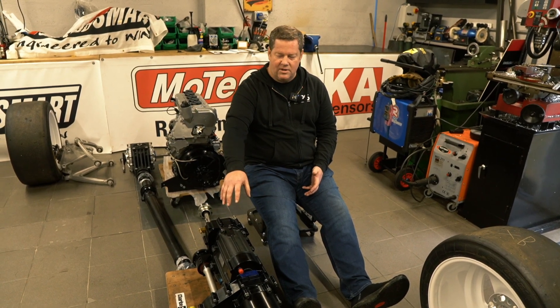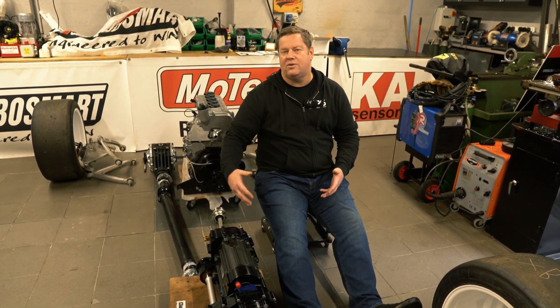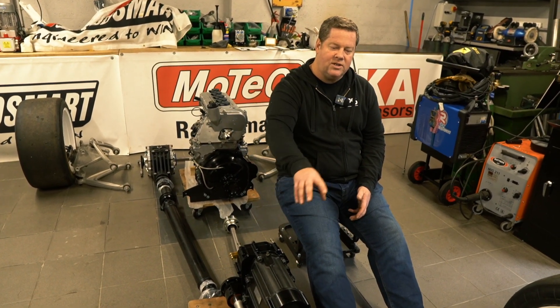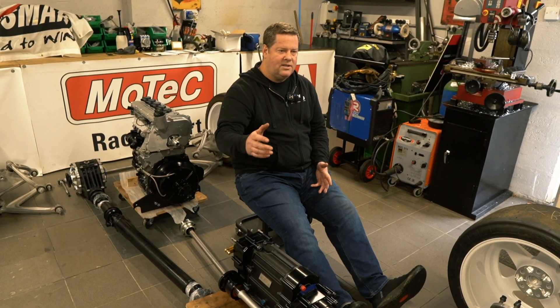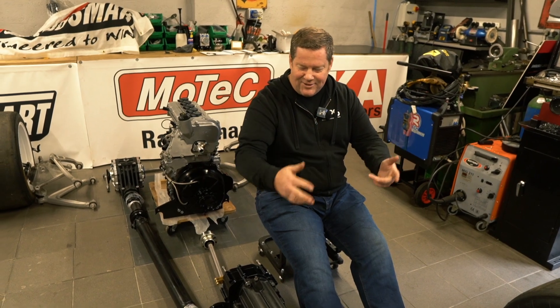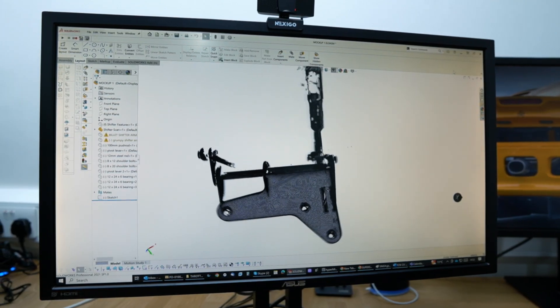If you put my big self down next to this and then try to have a co-driver, you just won't be able to fit into the car — the car gets too small too quickly. That's why we have to have this drive shaft extension, which gets joined to the front diff just there. That gear lever has been custom designed and it's going to join straight onto the transmission system, operated by the lever here — a nice mechanical connection, none of those flappy paddles. We're going to have a stick with a gear shift load cell in it, fully sequential.